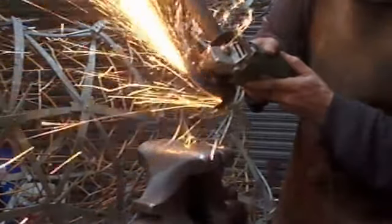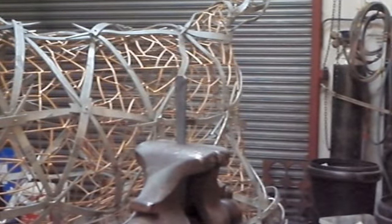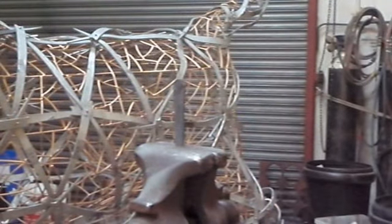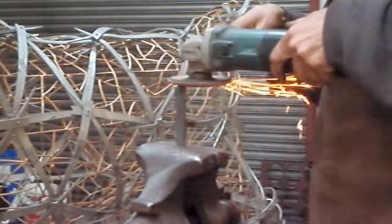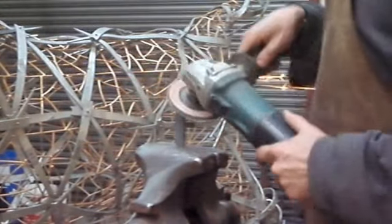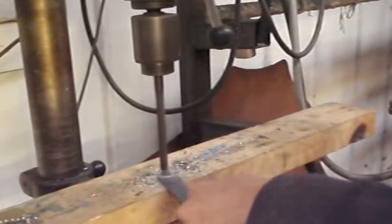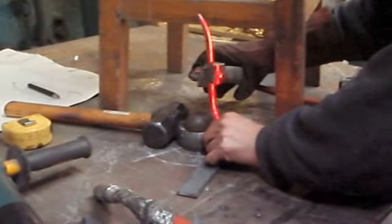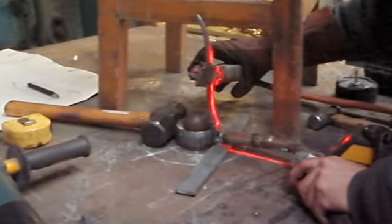I am just taking the corners off what will become the bottom of the tapered bar. Now I am just grinding that smooth — this is speeded up, it takes a while actually to do this — and then a sanding disc, and then I drill a hole. And that one is now ready to weld onto the side of the block. So very carefully positioning the block and the taper, I weld.